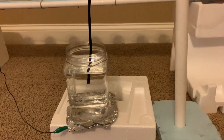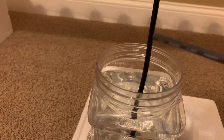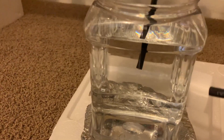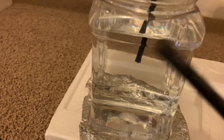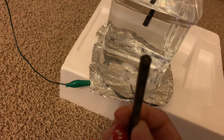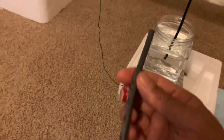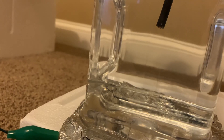One of the key things to get this experiment to work is to have some thick insulated cable. Otherwise it's just going to jump right through the cable and you won't get a concentrated charge right at the end. So you need typically this sort of cable, which is rated for high voltage — this is rated for 30 kilovolts, even though I'm putting 400 kilovolts in it. And you basically snip the end off so that the wire is just barely protruding out of the end.